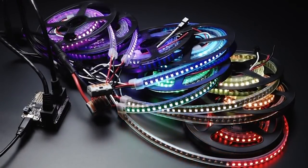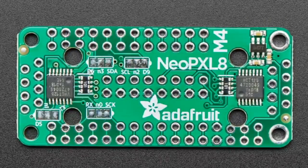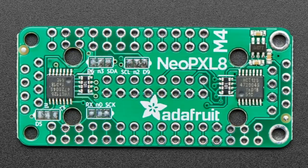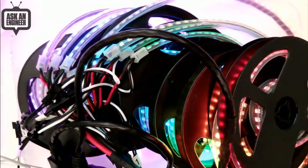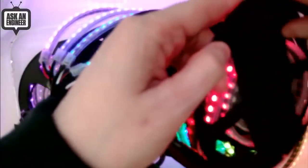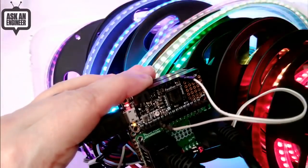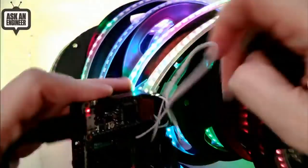And the star of the show is the NeoPixelate M4 Featherwing. I'll clear some space and show some photos of it. This PCB is green because we're still waiting for our primary PCB fab to come back from their Chinese New Year slash COVID break. What you're seeing here is eight NeoPixel strips of 144 LEDs — red, orange, yellow, green, blue, purple — a lovely rainbow of colors. They're all connected to this Feather M4 here with the NeoPixelate Featherwing. It has level shifters on it, and connectors that are either Ethernet or plain GPIO breakouts.